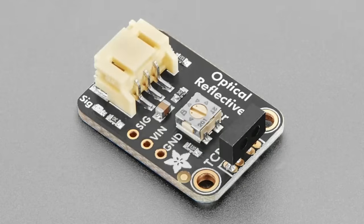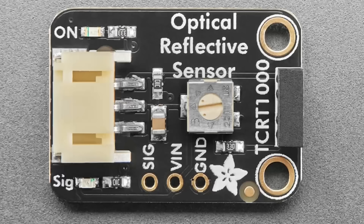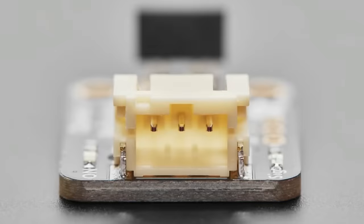There's a potentiometer in the middle so you can adjust the LED current from 1mA up to 100mA, which is the max range. This is one of the few right-angle optical reflective sensors we carry that's all-in-one and ready to go. You can plug in a JST PH 2mm pitch cable or solder to the pins on the board — a very easy way to get started with a photo-reflective sensor.